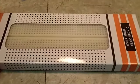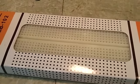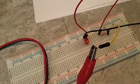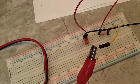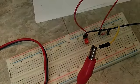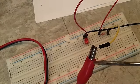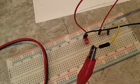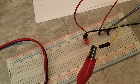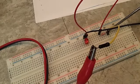That'll be fun. We always like the breadboard thing, so let me get set up for that and we'll take it away. Alright, what we have here is our circuit, and it's all wired up like it's supposed to be. If I can find me a nice pointer here, let's just use a screwdriver. Here's our positive leads coming in. It goes to the end of this resistor. By the way, I did check the resistor. It measures 996, which is very close to 1000.